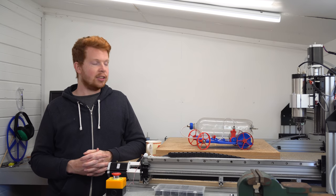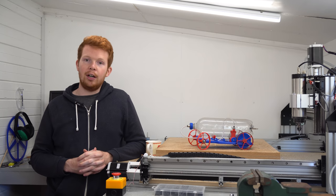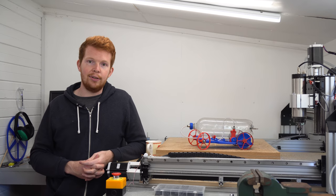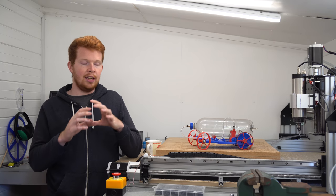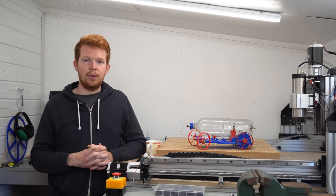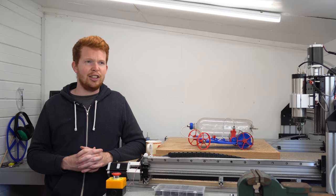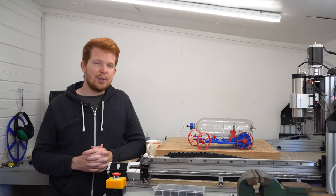It's been a little while since I've made anything air powered, such as this air powered car. If you're one of my subscribers you've probably seen the video, but if not I'll post a link in the description below. There were some issues with the car running at pressures above about 30 psi due to the design of the air inlet valve, and also because this engine is only a plastic piston running inside a plastic cylinder - it wasn't properly sealed with any kind of o-ring, which meant the engine was relatively inefficient. At pressures below 30 psi it didn't run for very long, and the longest distance it traveled was maybe 20 meters or so.